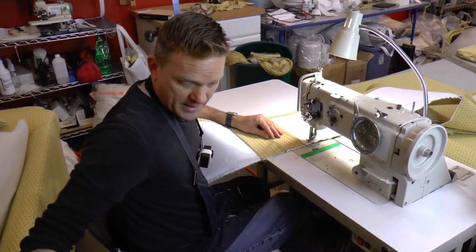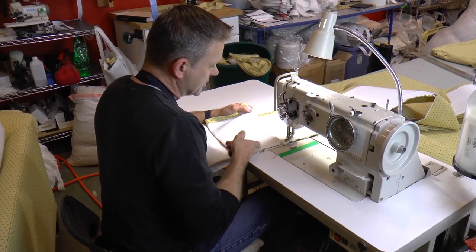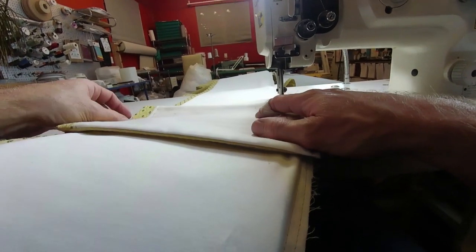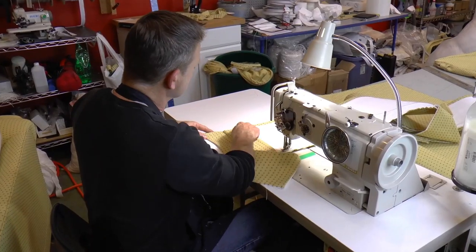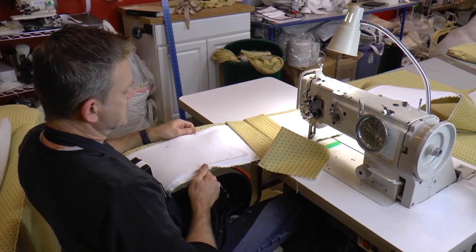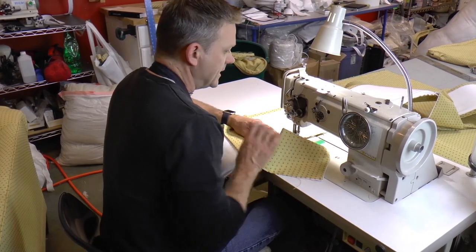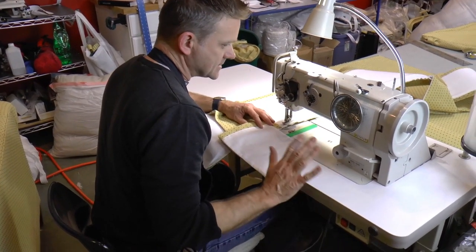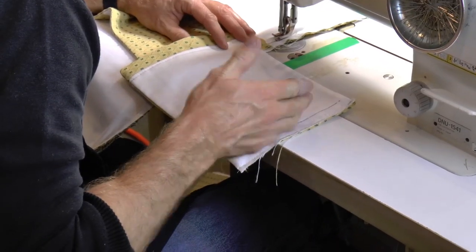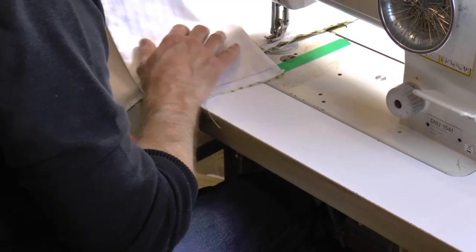Okay, so now we're going to do the back panel. It's important to raise the back panel. There's another little trick. I made marks for us to make it a little easier. Up a quarter or 3/8 of an inch, okay? If you make it even, it's going to drop down, similar to what happens at the corners. So we're going to raise it up 3/8 or a quarter. All I did is I took this marker. It's a guideline, not a guarantee, okay? This should be about 3/4 of an inch down, because it should have been a 1/2 inch. So I went down 3/4, and that would give us a quarter up if I follow the pen mark, okay?